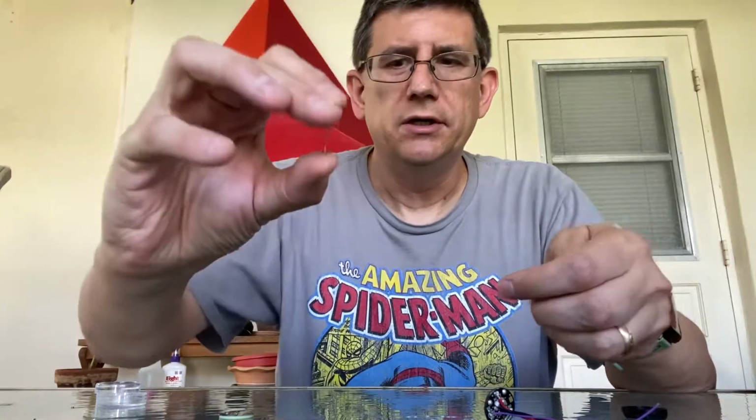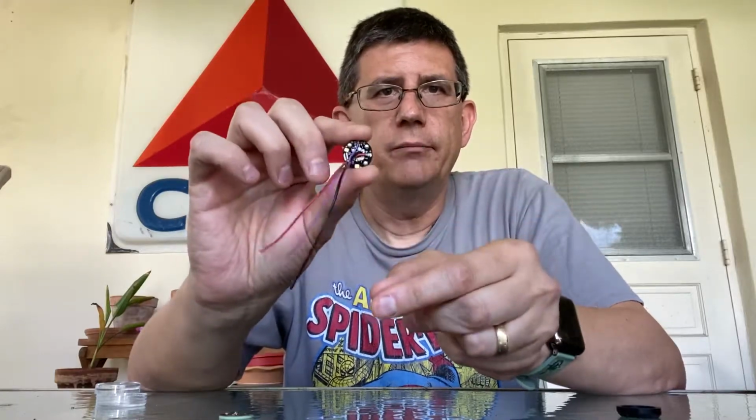The other thing I did was I cut that little piece of plastic like I said I was going to do in that last video, really thin. You can see how thin that is. What that'll do is sit at the bottom. This PCB will sit right on top of this. We'll cut a hole right in the middle for the wires to go through. PCB will sit that way so your wires won't short out on the inside of the hilt. So it'll be a little barrier between your pads and the bottom of the hilt. So we did that. And what we'll do is we'll get this emitter all glued up into this emitter holder here. We'll get that glued up tonight, get that installed.